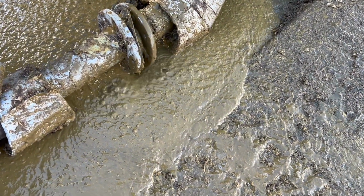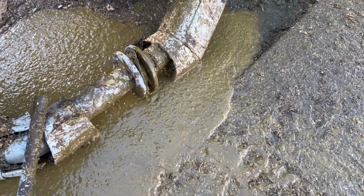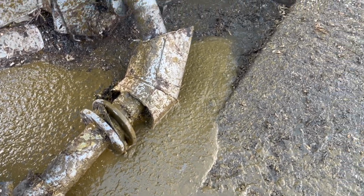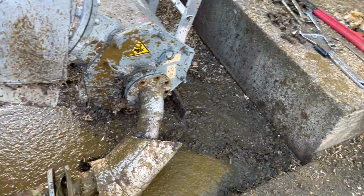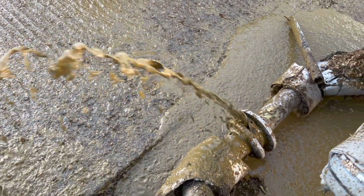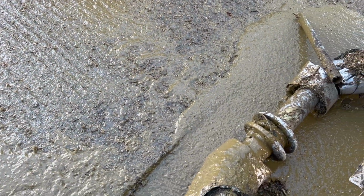So you see that, guys? A whole load of stuff came out there. That's the pressure, because it builds up from the pump, which goes up to about 2 bar, and then it also builds up with the gas inside. It's just hissing as I'm taking off this top one. It sprayed all the way back to that cone over there, so there's a lot of pressure in there. That's why I got myself nicely covered. I only just managed to capture the back end. It's gone all the way over there. Let me tell you, you just want to be out of the way of that.